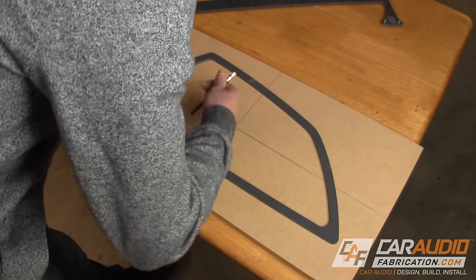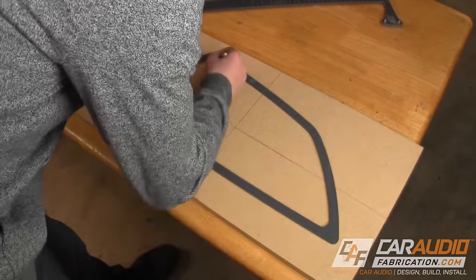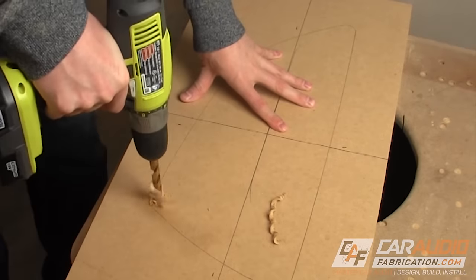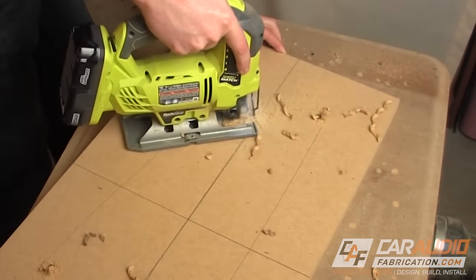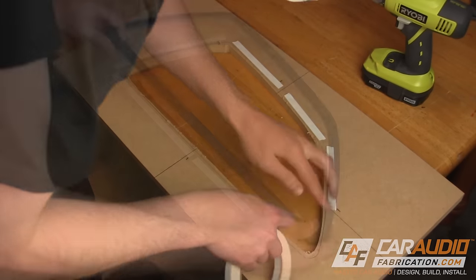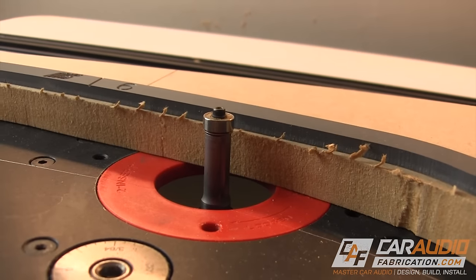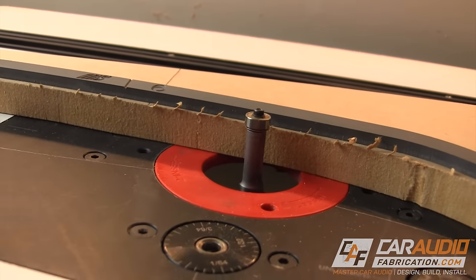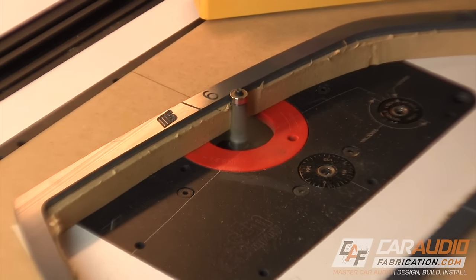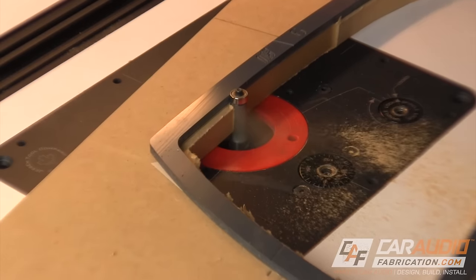For this part of the process, you could always use a freehand cut hole using a jigsaw, but because I'm looking for a perfectly smooth shape, I'm using a smart template. I carefully mark its shape onto the side of the box and then use a jigsaw to rough cut that shape. Next, I use double-sided template tape to stick the template to the side of the subbox. Over at the router table, I've loaded in a half-inch flush trim bit. This bit has a bearing that rides on the template and the cutters copy its shape to the wood, giving us a perfect copy of the shape for the window.